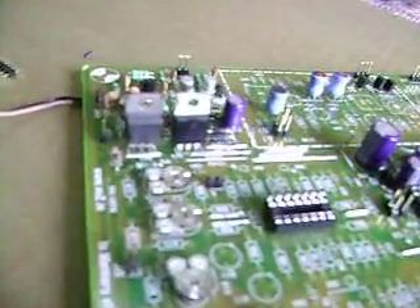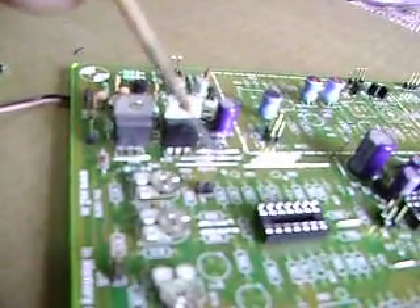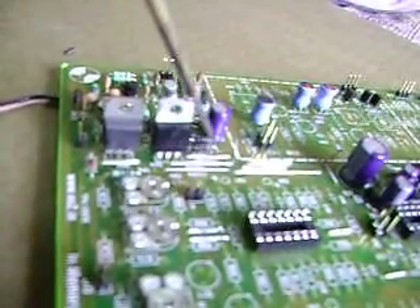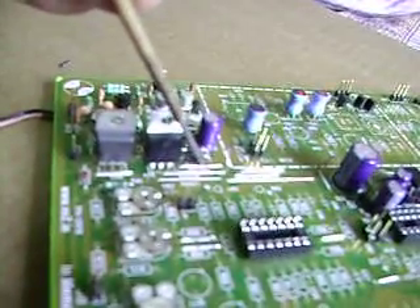As you can see, there are a couple of jumpers that you need to put for different voltages. It's all mentioned on the board — printed in the silk screen printing, showing what each segment is for. To start with, you just need to connect 12V TX and 12V TRX. No point in putting a receiver supply right now.